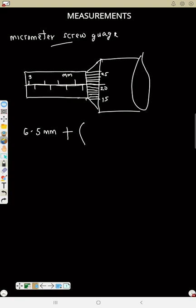Trace it exactly where it coincides. You see where it coincides there. That means the line coincides on, if this is 15, you are counting 1, 1, here 15, here is 16, 17, 18, 19, then 20. So you are counting 1, 1. So that means if here is 20, then the place where this line coincides here is 21. So that place is 21.